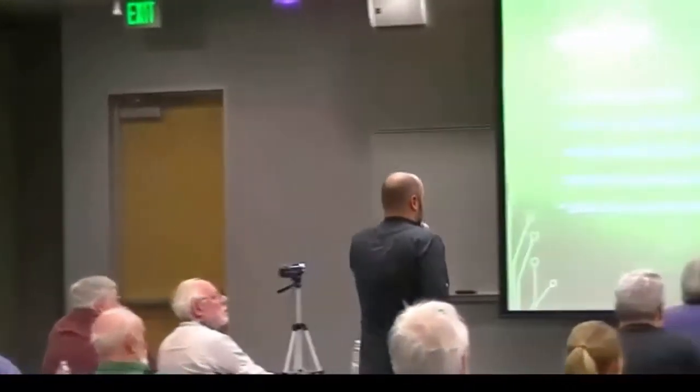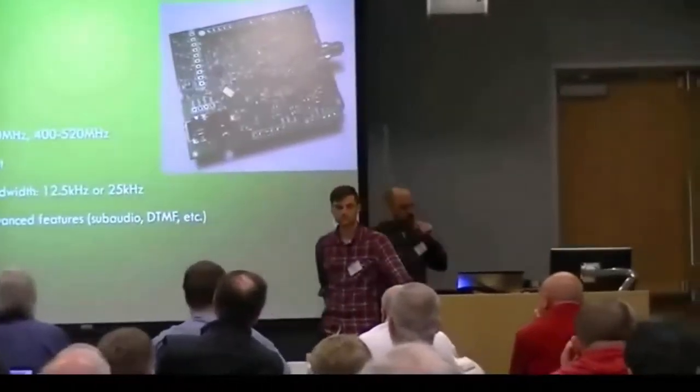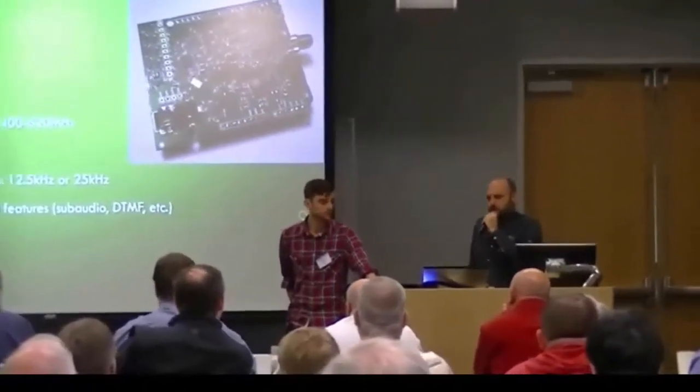Well, that's a really good point. We've been able to leverage a lot of different tools, and as an amateur radio kit, as long as we're within the spectral requirements the FCC has, we do well. We can't really get a board certified anyway. The FCC doesn't certify modules like that. But we used a variety of test equipment, spectrum analyzers, and we've looked at the spectral purity of the radio, and it's within compliance. We put a great deal of filtering in, which might knock the power down just slightly, but for the most part it works really well, and it keeps us within the emission requirements.